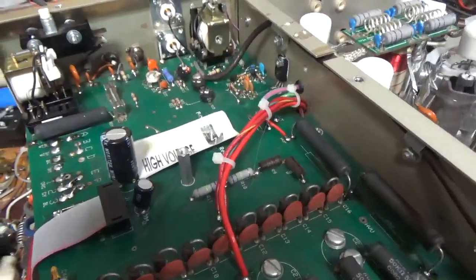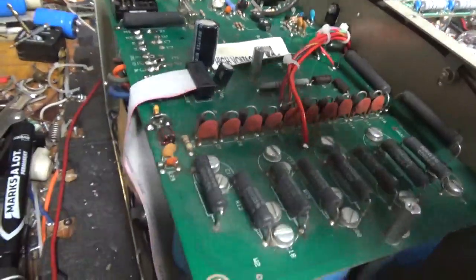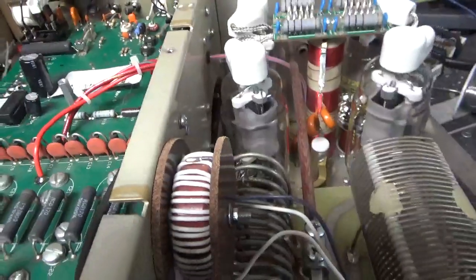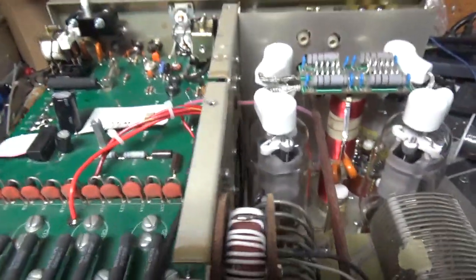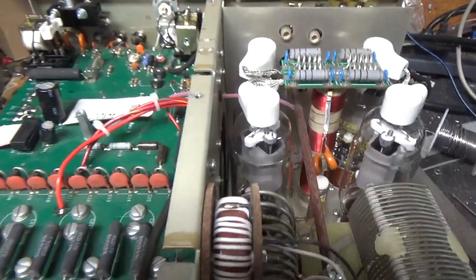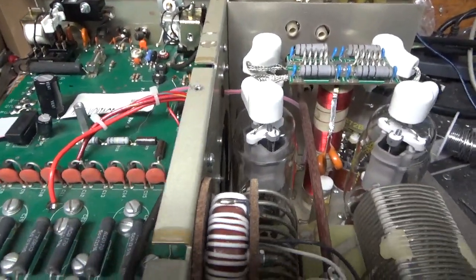This customer only wants to put some money in it — he already has a bunch in it because of the transformer. I always tell people to use an external meter; don't ever go by the internal meter. You always want an external meter for measuring your output. It's just a relative meter that's in the amplifier.